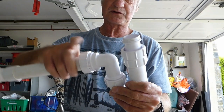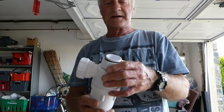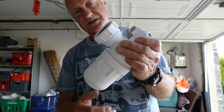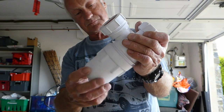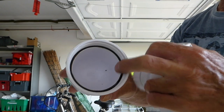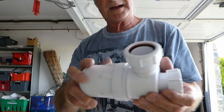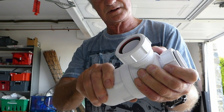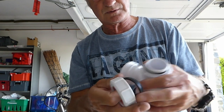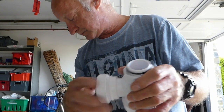Moving on back to the bottle trap — this is quite a common one seen under sinks. If you find that washer is okay and there's still water appearing at the bottom, another thing with bottle traps specifically is the actual washer seal in the bottle itself. It could just be loose — it's worth trying to tighten it first. There's a little black washer down there that could be the one that's gone. Just give it half a turn by hand — not with anything on it — and it will be tight. All the pipes going into these traps have the same arrangement with the washer.